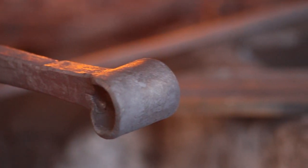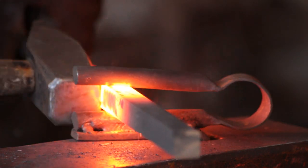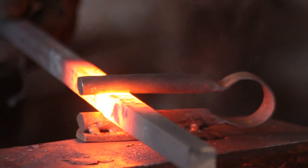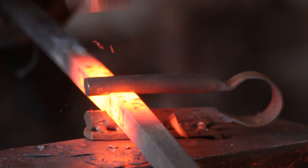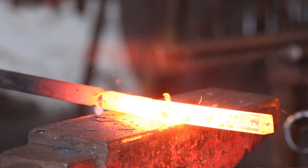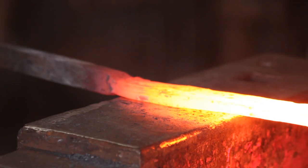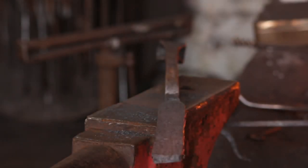I will then go down to a second mark which is further down the shaft — I believe this is 20 inches from the base of the eye from memory. At this stage I will use a spring fuller. This is normally my power hammer spring fuller, but I'm not using a power hammer for this video, so I'll drop that in the hardy and do a double set down with the spring fuller on the same face as the eye. I'll keep the steel quite clean because I don't want to push any scale in there which will mar the finish. With the cross-peen I will spread out the material to a width of one and a quarter inch. I've left the material over thick because I'm going to forge weld a carbon steel bit on, and I want the extra thickness to compensate for any wastage which might occur.